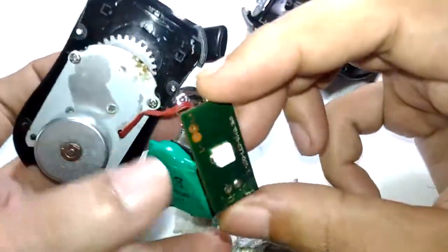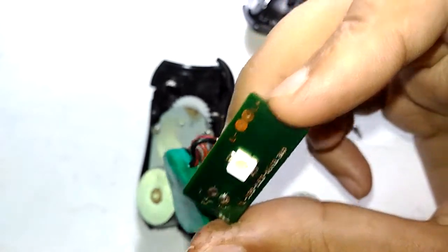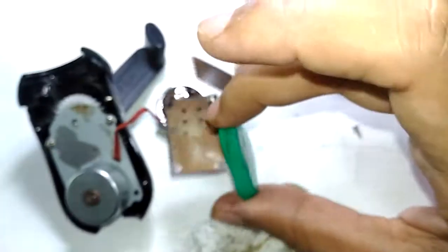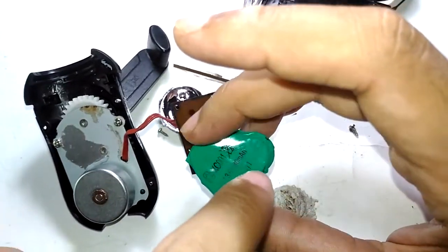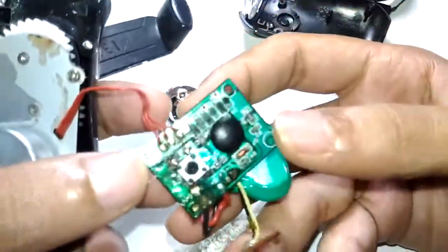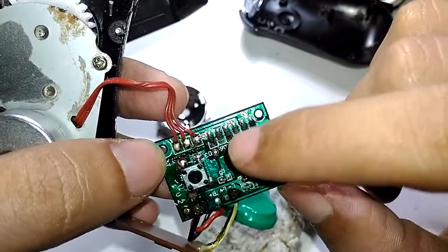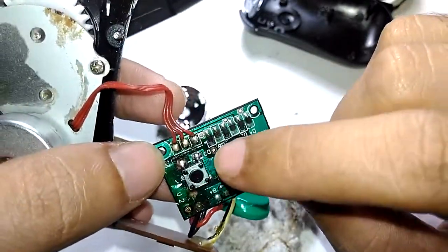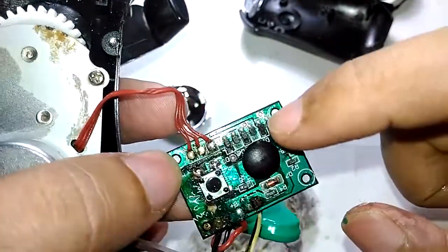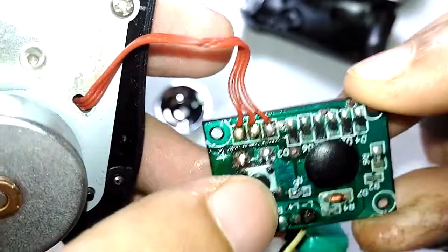The LED is marked TL100 and says 3W. The battery uses watch-type cells — three of them connected in parallel giving around 80 milliamps. These are rechargeable nickel metal hydride batteries. Looking at the circuit board, I can see a lot of diodes. There are three wires coming in, so I'm guessing this is three-phase AC coming from the dynamo, and it's using six diodes to rectify it.